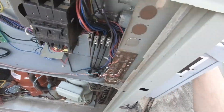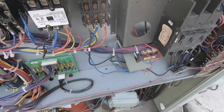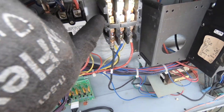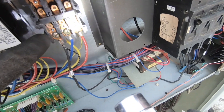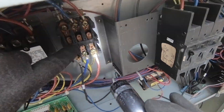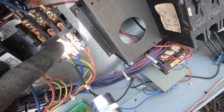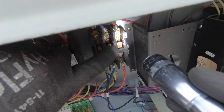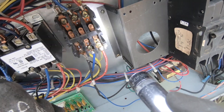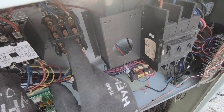I'm here doing an all-day maintenance kill power and one of the things I ran into was right here — this contactor starting to burn up on the contact points. You can see the bottom here has some burning happening, then this middle one and a very little there. So we're going to replace this contactor today before it causes any problems.